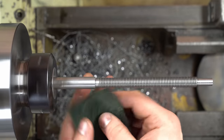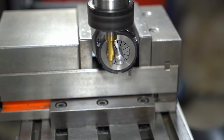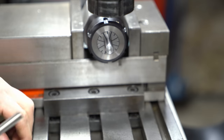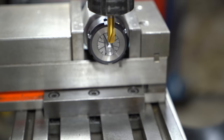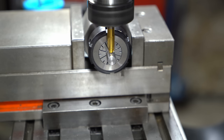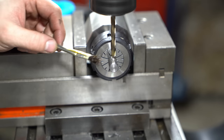The rest of this shaft is left at 12.7mm and cleaned up with a little bit of Scotch-Brite. Now the lead screw is in the mill in the collet block and I'm setting up to drill the cross hole for the T-handle. I've been making an effort to standardise on 10mm tools so I'm not changing collets all the time — a 10mm pointer tool, edge finder, spot drill, countersink, carbide chamfer mill, and ordinary 10mm end mills. I know it only takes 10 or 15 seconds to change a collet, but when you think how many times that happens per project I think it's a big time saver.